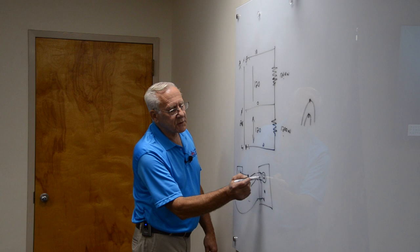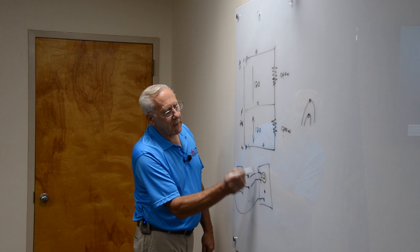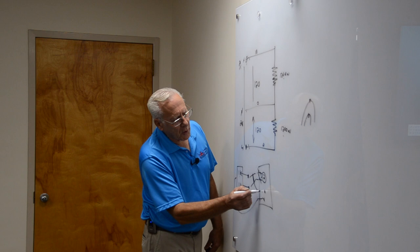I've seen it 100 times. I'm telling you, it happens. People that don't know what they're doing inside of a panel. So they take the two wires off, they put their air conditioner on there, and they say, oh, I got it. Don't worry, boss, I got it. And they took these two wires, put them together, and put them on a single pole breaker. Now, this wire and this wire are on the same phase.